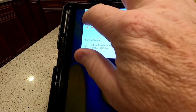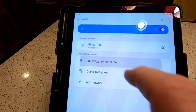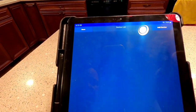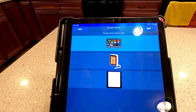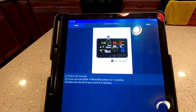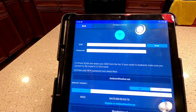Before I connect to that Wi-Fi being transmitted by the unit, I want to make sure I have the AWN Net app. Under my Wi-Fi scan page I can see the weather station's network, so I click on that. Then I go back and open the AWN Net app, hit 'Add a Device,' select what my device looks like, and hit next. This screen just tells you how to put it in Wi-Fi mode, which I've already done, and I'm already connected my tablet to that Wi-Fi. I'll hit next.